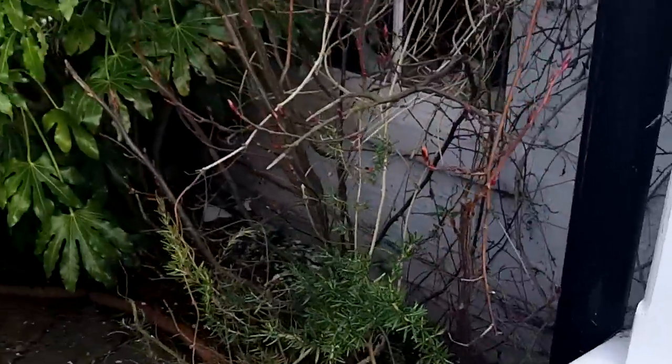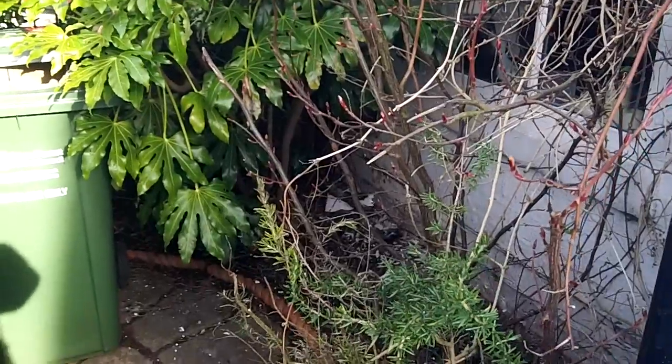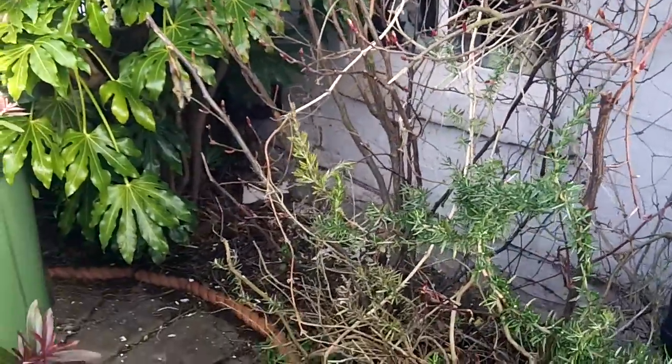If we now go inside you'll see what's happened as a result of all of this. We've got the garden wall up against the external wall trapping moisture, and we've got plastic paint trapping moisture. This is our internal corner — and if I highlight that, you start to see dampness. All of this is quite damp and wet. Very typical problems which most damp companies tend to say is rising damp, and of course it's not.